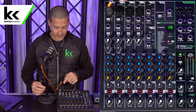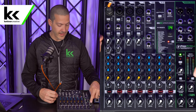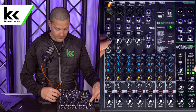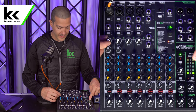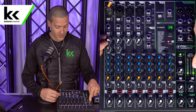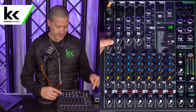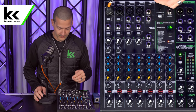With that in mind, we are going to set the gain here. Mackie wants you to unmute the channel — we're going to hit the 'to phones' knob, which will activate the meter. We're going to bring up the gain and we can see the meter starting to move. We're turning it up all the way to 10 out of 10 — we can see we're way past where we need to be, so we're going to back it up. We'll lock in somewhere around 80%, probably about three quarters. We want to go past minus 20 and just barely bump minus 10 if we get animated, since we're in a studio recording environment.